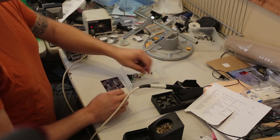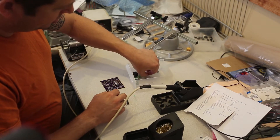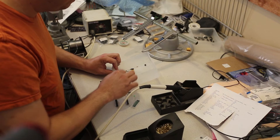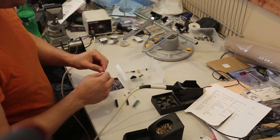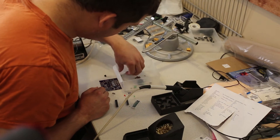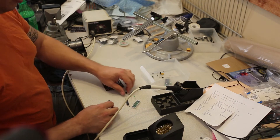What I'm going to do is pick out the pieces I'm going to install in the first wave: both ICs, both LEDs, the four-digit and single-digit seven segment displays, the crystal, and the tactile switches. Then I'll come back and fish around for some resistors in a second.